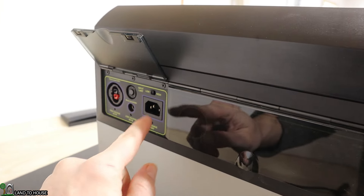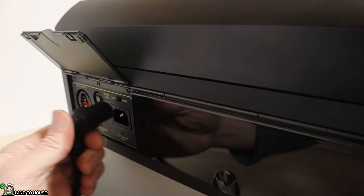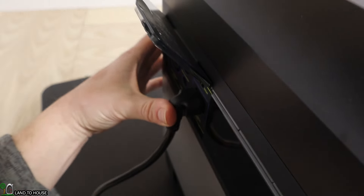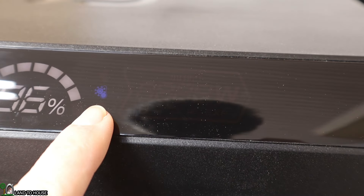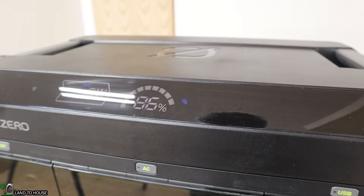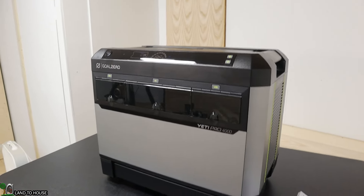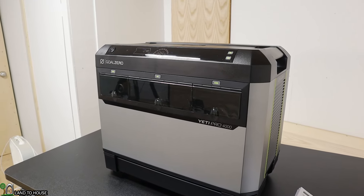I'm going to lift the input flap, make sure the input switch is turned to low — and it is — then plug this in to start charging. Although the warning message went away, I'm still seeing a snowflake indicator. Checking the user manual, that indicator means the battery state of charge is cold. So I need to roll this power unit into the other room where there's a heater to warm it up, even though this room is above freezing. The battery is just showing it's too cold to charge.